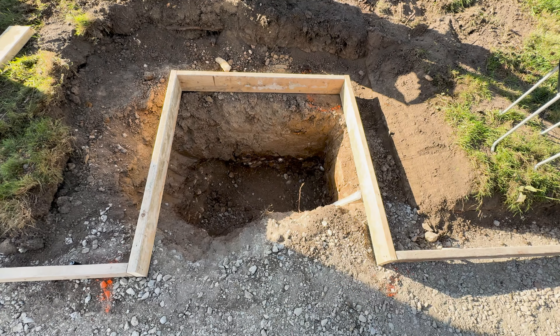We did the same thing here — you can see the synthetic felt all the way around the edge. Walking down toward the driveway, some key things to think about are especially where the water runoff is going. We used the same rebar pins along here because we want this slab to float with the existing slab, and we did this with the old concrete all the way down.